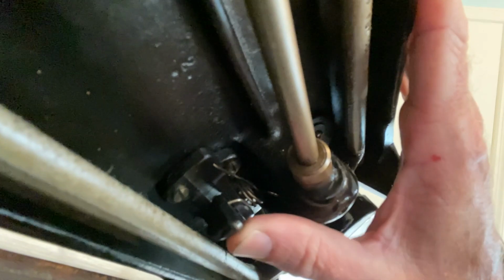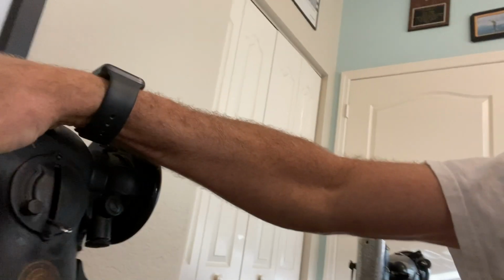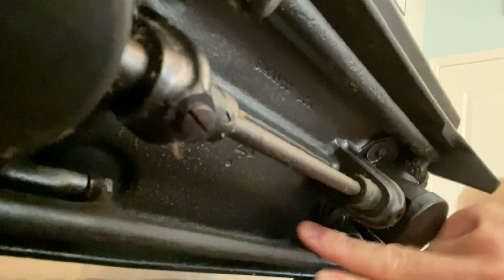So when I say a knee lift, I mean a lever you actuate with your knee or your leg that lifts the presser foot, not something that makes the machine go. If you have an old vintage machine with a lever like this, that's not a knee lift. Go push on it and see what it does, and you'll find that it probably does nothing because the pedal's not inserted into that bracket, but it's not going to raise the foot. For a knee lift to work, it has to have some mechanism to engage with the presser foot. And you can see on the 1200 it does, and on this 201 there's nothing there.